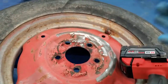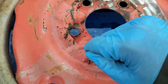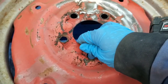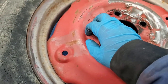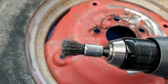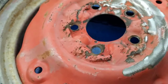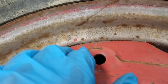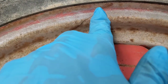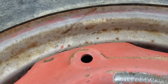So what I'm doing right now specifically — we got one of the rims. This isn't the one that we fixed, but you can see it's been poorly repaired in the past at some point, and we're getting ready to paint it. What I've got here is just a wire brush on the drill, and we're just going to run that around on top of everything here. What it's going to do is take away the rust. You can see there's a lot of rust and a little bit of corrosion on the surface here, and here's where I've run the drill — you can see it does a fairly nice job of taking that surface crap off.